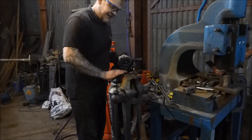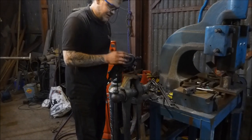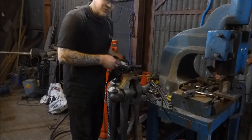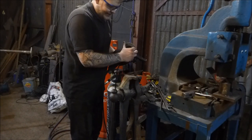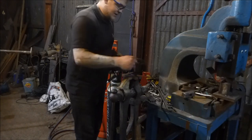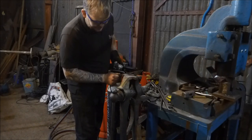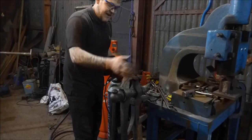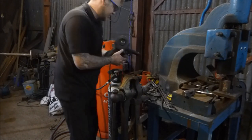I've got an angle grinder here. I'm going to use it just to dress a few little bits. I like doing the edge. I'm not going to go hard with the angle grinder — I'm using flap discs that are slightly worn, a 60 grit and then a 120. All I'm trying to do is just tidy this up. I've quenched this off as well. But you can do this with a file, a grinder, a linisher — it depends on whatever you've got in your workshop.